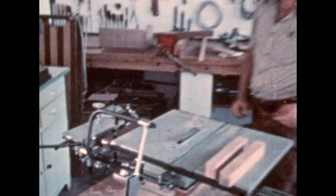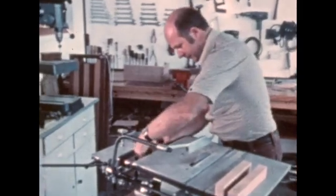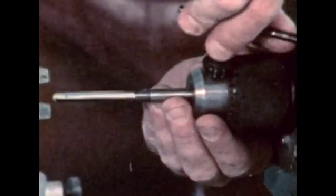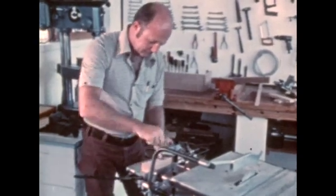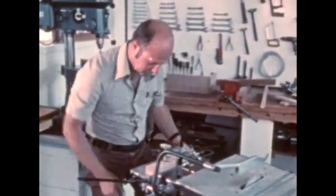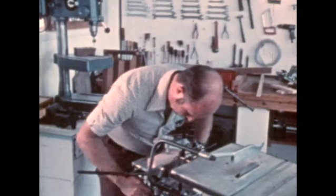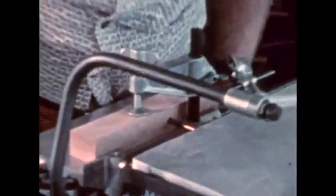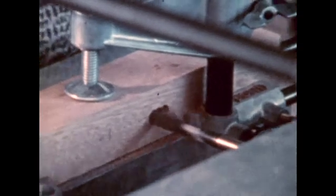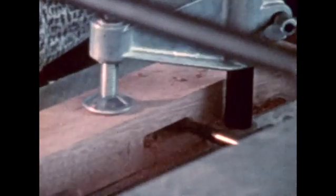And now for the mortise joint. First, put the safety cover in position. Then fit the cutters, and cutters are available in sizes ranging from 6 to 9 millimeters in width. Lock the timber in position, and then adjust the various height, depth, and traverse stops. Then simply feed the timber through and one last cut to clean the mortise up.